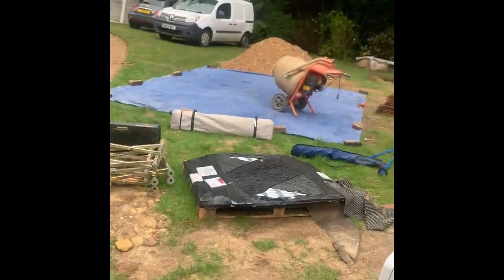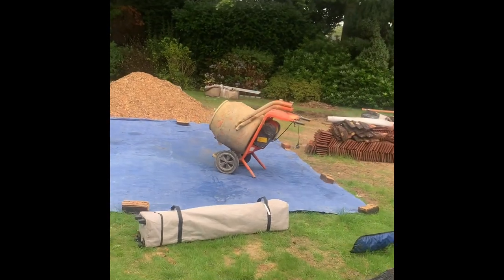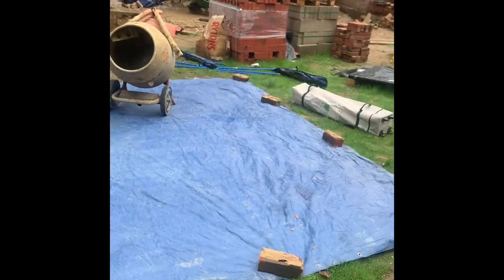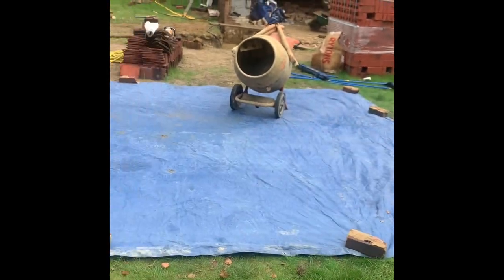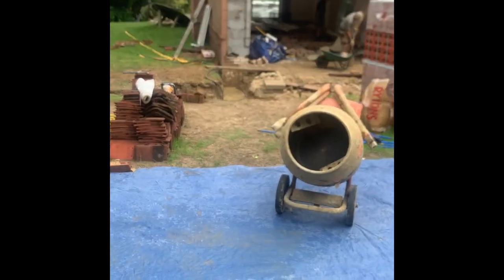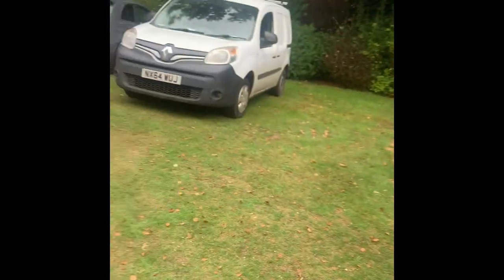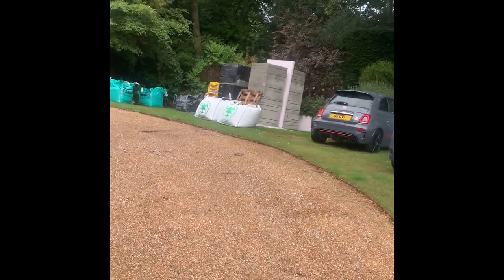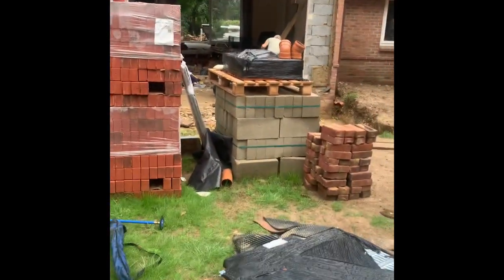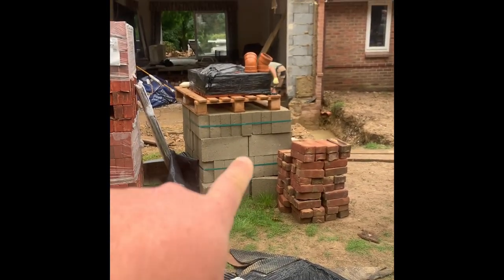Plenty of room to move about. We've got three sheets of OSB underneath here giving us a solid ground, more sand coming down, and we've even got the gazebo if we need it to cover the entire area - somewhere nice and dry to get a break out of the rain because the weather is turning. We've got all the blocks - getting on for eight packs up there, two packs of bricks for the four courses below damp, and dense concrete blocks for the piers.